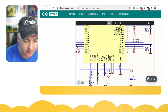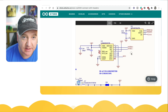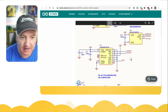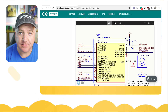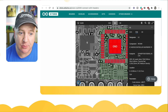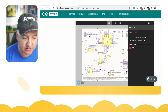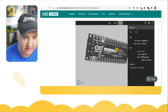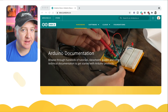One of the cool things provided in the documentation is an interactive schematic on a web page. We can zoom in, see the pin outs, and see all the different components — for example, the 3D accelerometer and 3D gyroscope with all its pins, and the microphone, and the built-in Wi-Fi and Bluetooth. We can click on a component and see where it is on the PCB board, and there's also a 3D model so we can view what this looks like in 3D. Pretty cool that they've included this in the documentation.